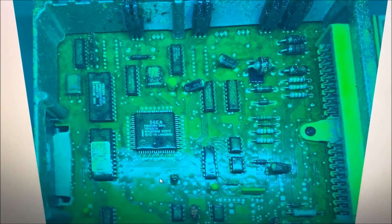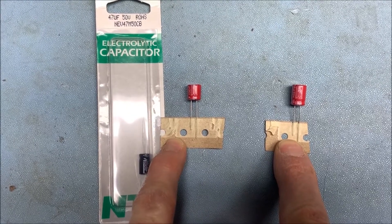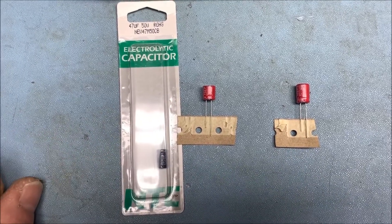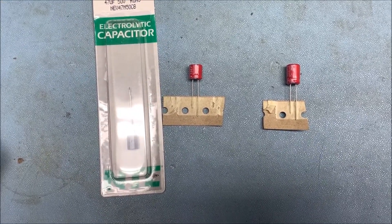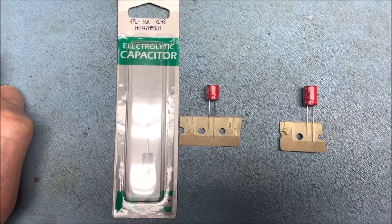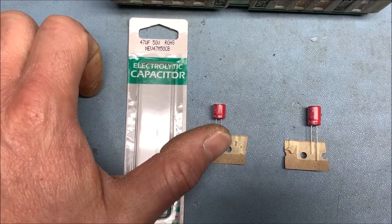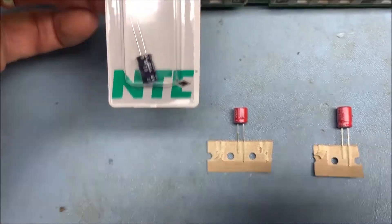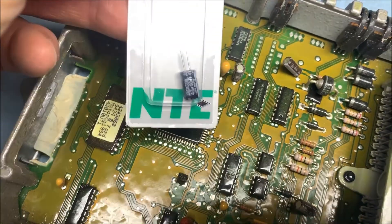I'm going to replace them anyway. I'm going to do an experiment this time around and use some aluminum polymer caps, which won't leak — they don't have liquid electrolyte in them like the original style did, with the exception of this one. I had a whole set but couldn't find one, so I'll use a standard style in that position. The 47 microfarad caps have a much higher voltage rating; the original was 16 volts, the standard electrolytic I have is 50 volt, and the aluminum polymer is 25 volt. It's interesting how the size isn't much bigger than the old 16 volt one, just by the way they make things nowadays.